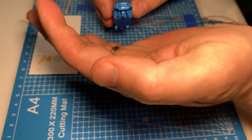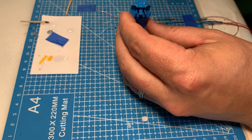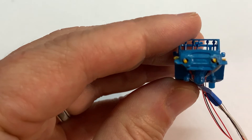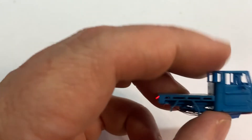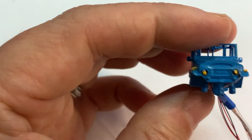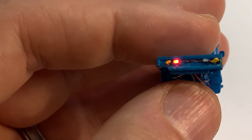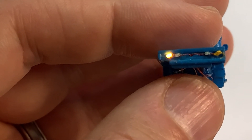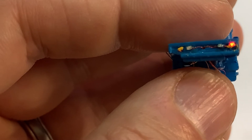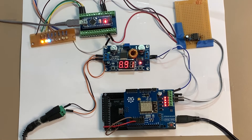I've tacked those wires down. In the interest of keeping this video short, I've gone through and added the headlight on the right hand side - the passenger side in Australia. Now I'll show you some of the lights working: you can see the indicators come on, there's the left one. It's just a matter of drilling a 1mm hole front and back and threading through, no different than with the headlight. Here's a better view of the rear end - it's meant to have two brake lights but I blew one during recording, so you can just see the little wire there. I've drilled a 1mm hole in four places for the indicators. Now I'll show you the DCC setup and the Arduino Nano running the DCC decoder.